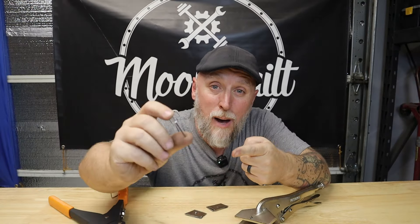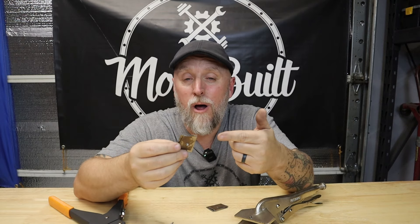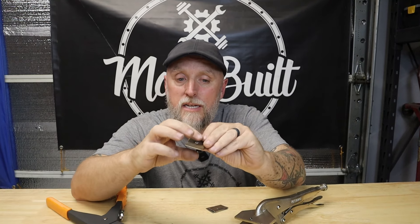What's going on guys, my name is Bill. This is Tool Tech Tuesdays — on Tuesdays I like to bring you guys tools that I've been using in my videos or on projects in and around the garage. Pop rivets — these things are a staple in sheet metal work. They're a quick and easy way to hold pieces of sheet metal together, but one of the problems you run into with them is the head of the rivet sits proud — it sits above the surface. What if you wanted to use rivets but have the head sit flush with the surface instead?